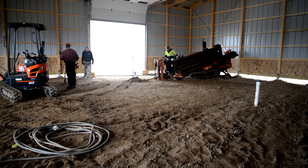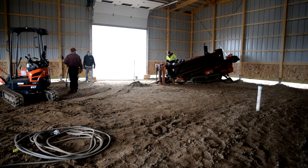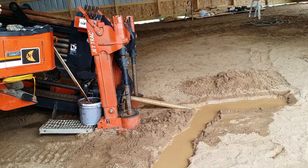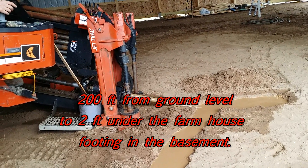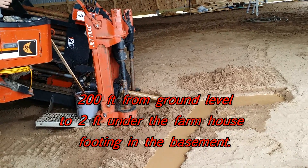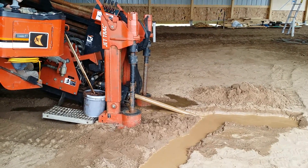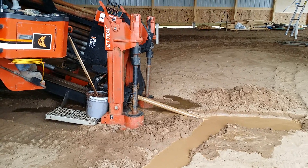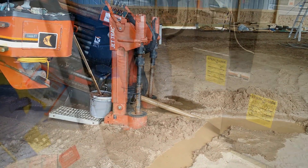Basically we backed up from our hole about 20 feet and started drilling horizontally, even a little bit down. In the course of 200 feet we dropped down into the ground several feet to get underneath the footing of the farmhouse, and came up where the well comes up into the house so we could attach to it — probably dropped about 10 feet over the 200 feet. They used pipe with a water bore tip, shooting water and chewing away at the dirt simultaneously, adding extensions and steering it electronically using locators placed along the way.